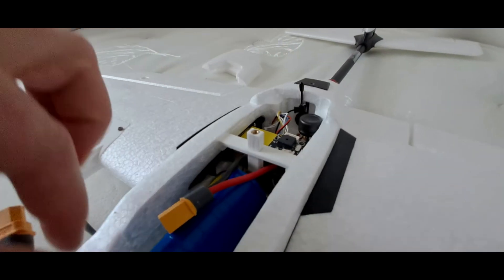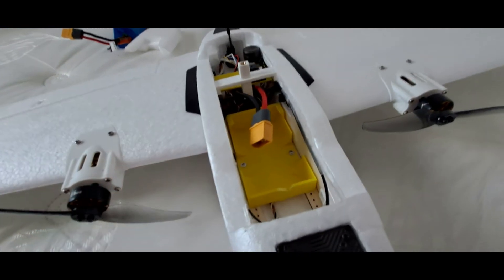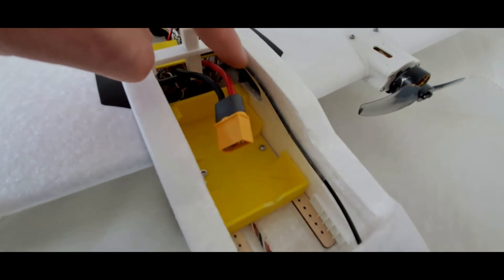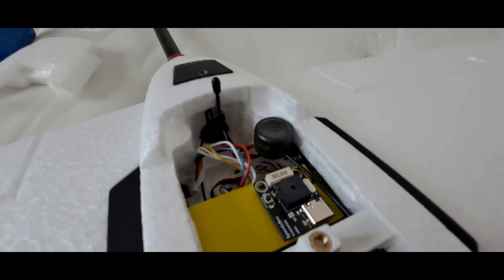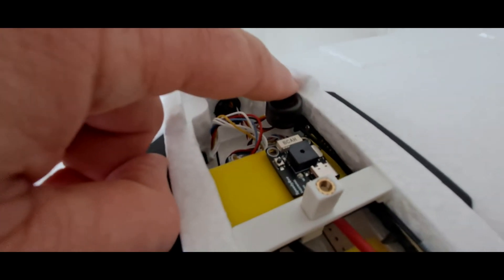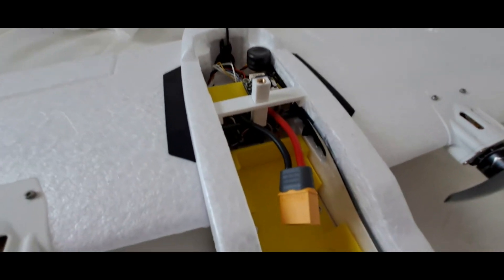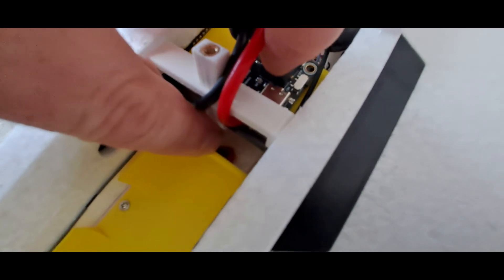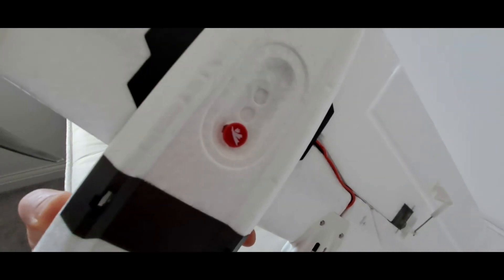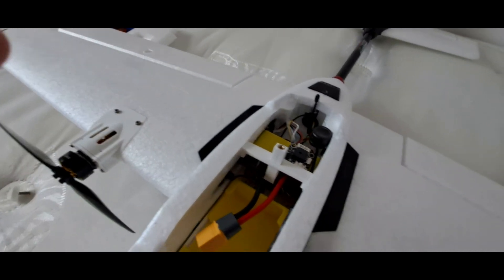Opening up the rest inside here — for the antennas, because there's not a lot of room and you probably noticed there was nothing sticking up, I've got a fully long side-feed antenna which I've just shoved back here. It'll be interesting to see how well this works. This isn't going to be a hugely long range plane, but I think that should be sufficient with the side view because these are brilliant antennas and there's not much behind it that's going to cause problems. The other antenna — following along this side — is one of the Singularity long antennas from TruRC, and it goes right down in there and comes out the bottom, so we've got a nice low-mounted antenna. Between the two I don't think we'll have any problems getting a good video signal.